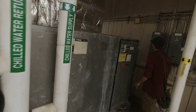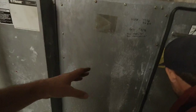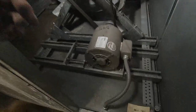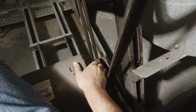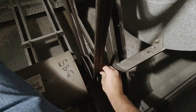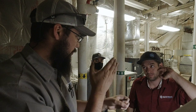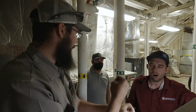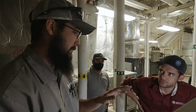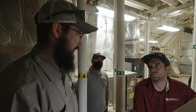We had high vibration with the belt on, pulled the belt, motor vibration settles out. I'm thinking it's because that adjustable pulley has not been adjusted and we're riding down in the bottom of it, spreading the belts apart. I feel like that's what's causing our vibration. This sheave is completely shut because that pulley is grabbing the belt. Because of the groove, the belt's having to break free every time it rolls around, pulling itself out at the bottom of that pulley — where it should just be a nice even glide. That's now damaging the bearings.